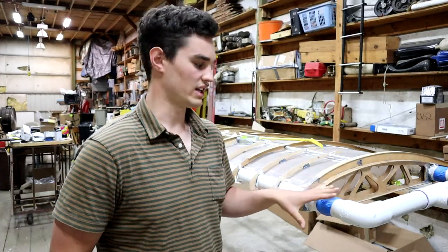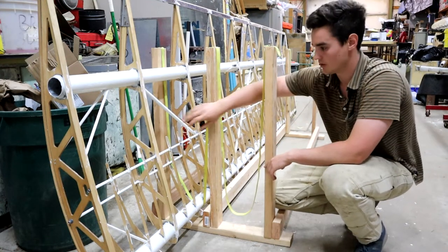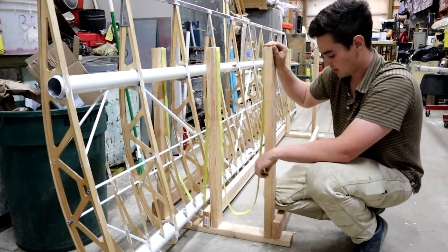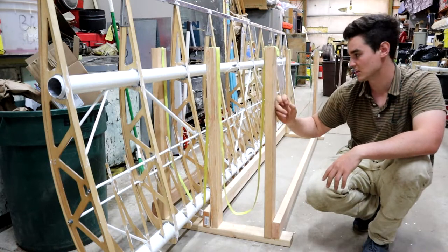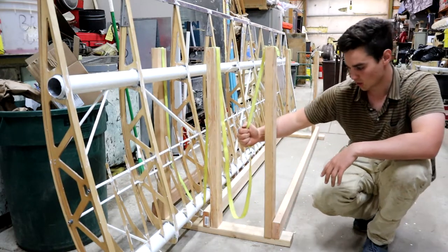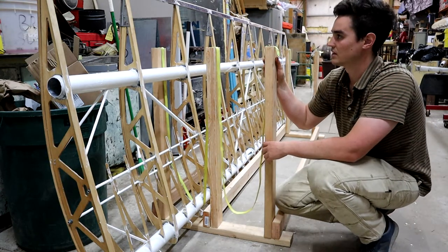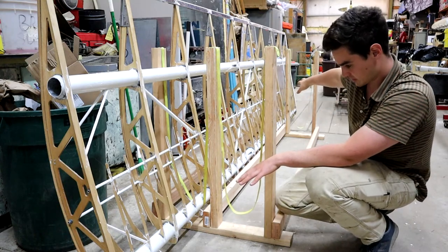Here's a cool side project: a wing rack. When I'm not working on one wing I put it in the rack so it doesn't tip. The wing sits on a piece of webbing — I stole this idea from Project Kit Fox, great YouTube channel. I used a full-length stud as the main upright, three-foot crosspieces spaced 10 inches apart, and another 3-foot base at the bottom. I cut down old ratchet straps to make the webbing and drilled them in at the top with washers. It's solid, it won't tip over, and I can store the wings at a slight angle so they won't collect water.